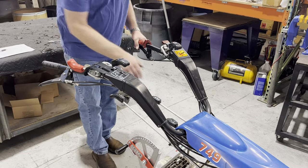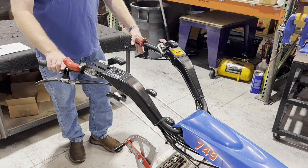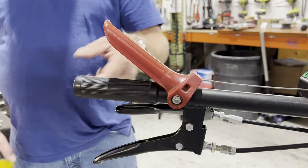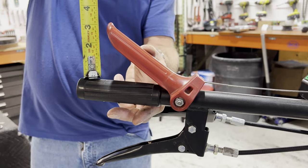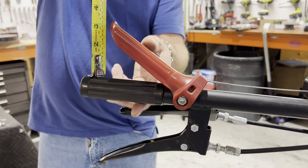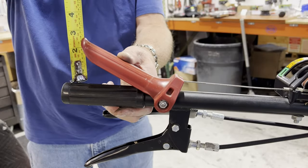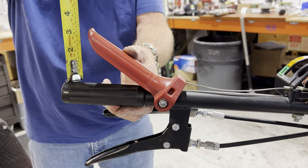Moving on to the OPC cable, the most common symptom that the OPC cable has stretched is the loss of power to your tractor and/or attachment when it's under load. Because a loss of power can be a symptom of other causes, check the amount of free play in the red lever before you feel resistance. If resistance is felt within a half to one inch, cable adjustment is not needed. If free play exceeds one inch, adjust the cable and test for power before proceeding to other possible causes.